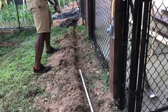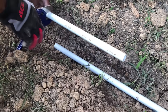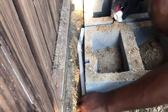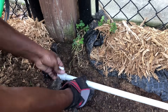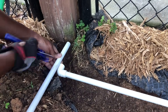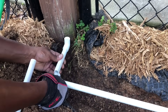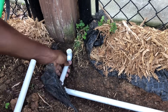For simplicity, and since I was going to modify this in the future, I chose to dig a four-inch deep trench to place the water line — however, check with your local code when it comes to installing PVC underground. For my water line I used one-half inch schedule 40 PVC, along with a series of 90-degree elbows and couplings. I would also recommend using PVC pipe cutters to make cutting the PVC a lot quicker — you can usually find these at your home improvement stores.